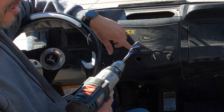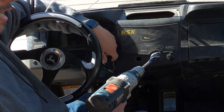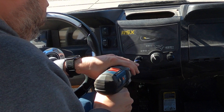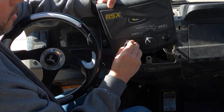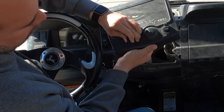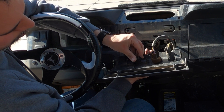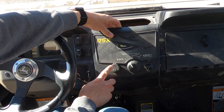The proper way to enlarge this is to get a larger drill bit. I have a one-and-a-quarter inch but I don't want to take it up to that size, so I'm just going to wiggle it around a little bit and see if we can get a little closer. With that done, I'm going to stick this through there, push it through all the way, and get it aligned how I want it. On the back side there's a plastic nut that came with this — that's going to hold it in place. Just put that on and tighten it down.